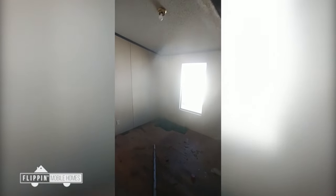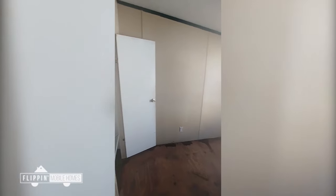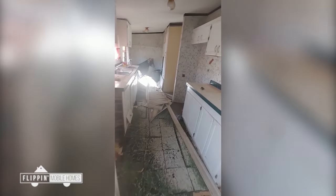There's another little bit of roof damage right there — it's not a problem to fix. Go up there, replace that plywood, put some shingles up, then come back in here with some sheetrock as well. Let's go on back and take a look at the master bedroom. Here's all the vinyl siding off the sides of the house — whenever they move a double-wide they always remove the siding so they can split it in half and move it. Master closet right in there for that room.